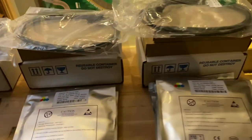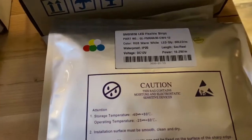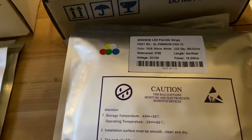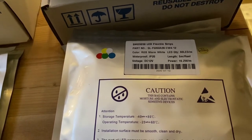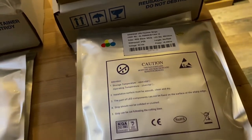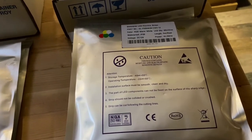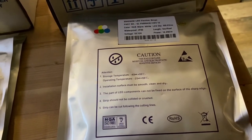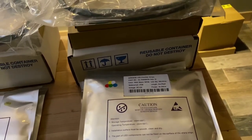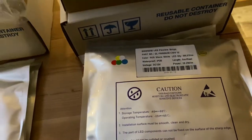The fourth zone of RGBW LED strip is for the pathway lighting — it goes basically all the way around the room. Built into the trim will be a half-inch black frosted channel with LED lighting all the way around. That can be dimmed or set to different moods: for gaming on an Xbox we could set it to green, for watching the Seahawks we could have that green and the soffit blue. It's roughly infinite color — we have 512 color choices with this system.